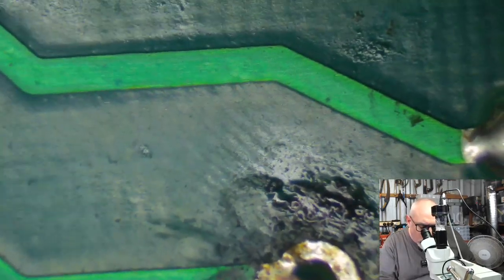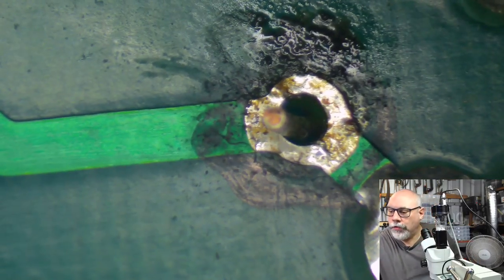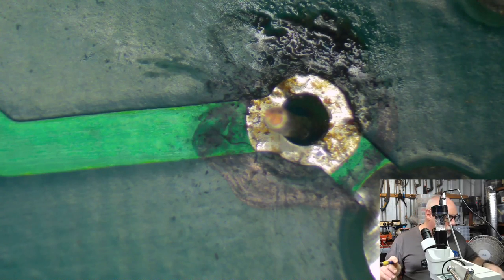So, capacitor, safety capacitor is in. Lovely, shiny blue one there. Maybe doesn't look original, but you know. Just worth mentioning that you can actually get paper capacitor replacements. You can get new Rifa caps, but unless someone specifically said to me, "Hey, I want you to replace it with an old Rifa paper one," I would always put on a nice new one like this. It doesn't look like it's going to explode in years to come.